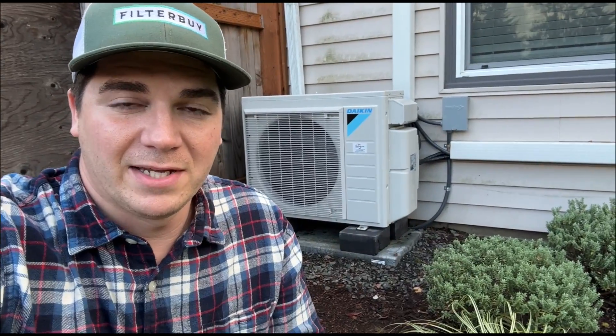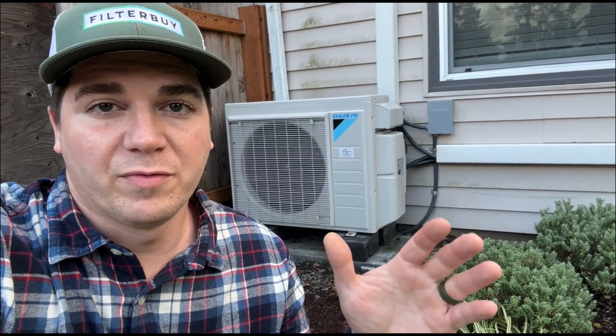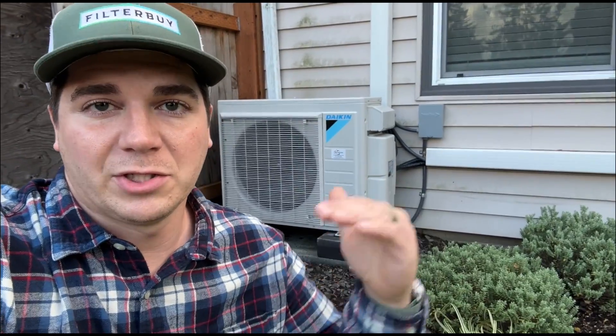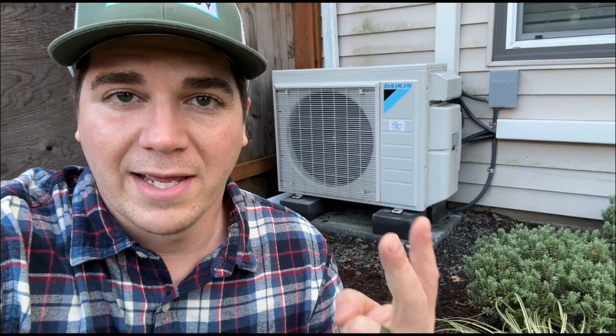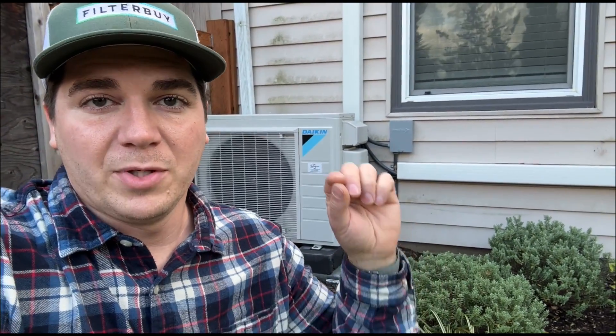That's my two cents on a mini split system. It's very neat, very functional, and doesn't take up a whole ton of space. If you have a finished basement or a rental where you want to remove the furnace and AC coil, this is an awesome setup. It also allows you to have two independently conditioned spaces — you could have a mini split downstairs and a completely different system on the other side of the home. You can get these in single head, two heads, up to about six heads, making them very versatile. And as you saw, you don't need one in every room — as long as it's relatively close and a door is open, it will condition that whole space.